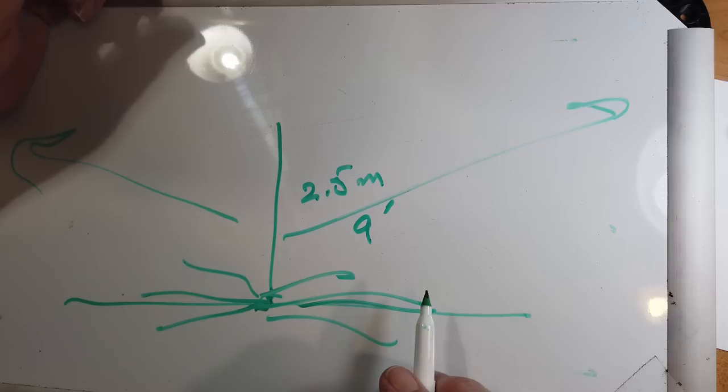10 meter antennas are in general smaller than other antennas — that's great — but don't forget the same principles apply. A dipole is a dipole is a dipole regardless of the frequency. If you've got a dipole that is a half wavelength long and a half wavelength in the air, you will get not only the same pattern, but the same capture area — it's just the way dipoles work. You can do the same thing with ground-mounted verticals, or go with a vertical a little higher, or go with a vertical dipole. So that gives you lots of options.